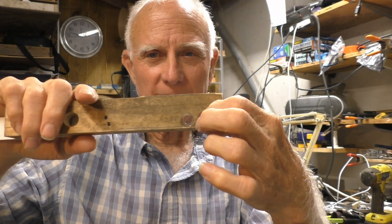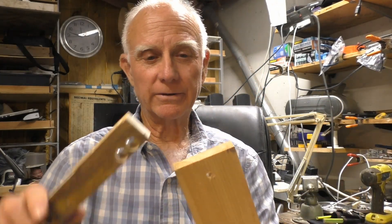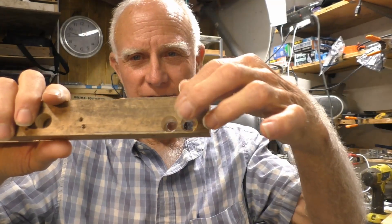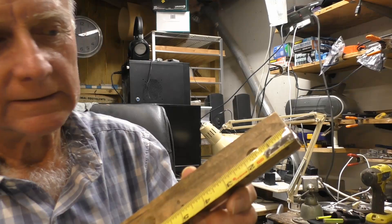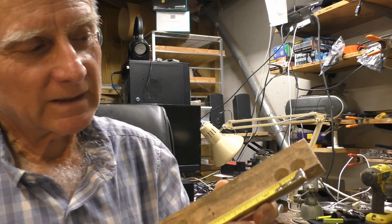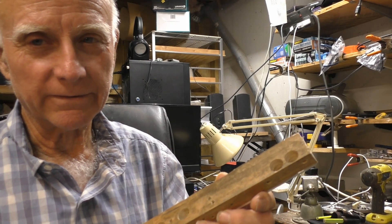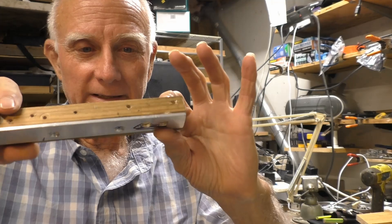The center space is real close to one inch. So if you've got two-inch material, you're going to get two holes in there without any problems. The first hole is about eleven-sixteenths and then one-and-a-half — probably three-quarters and then one-and-a-half — so that gives you enough space for two dowels into a piece of two-inch material, which is what most cabinet stuff is.